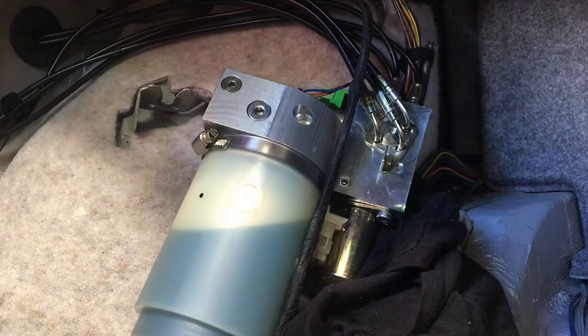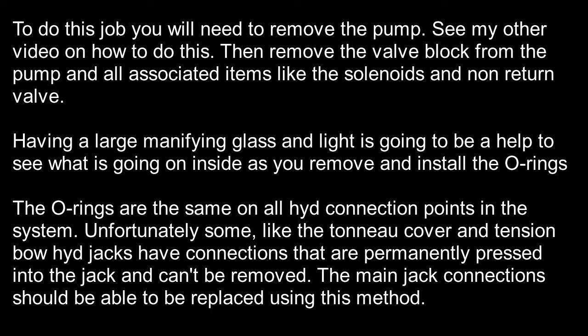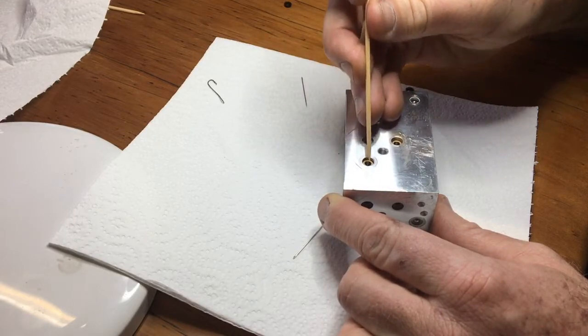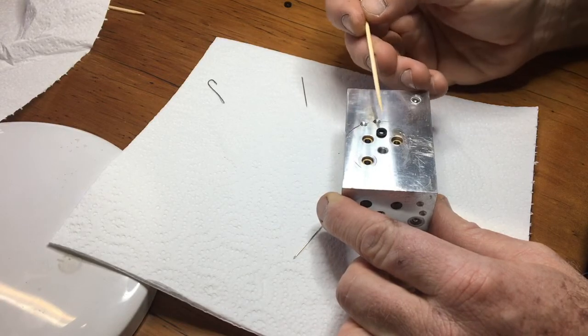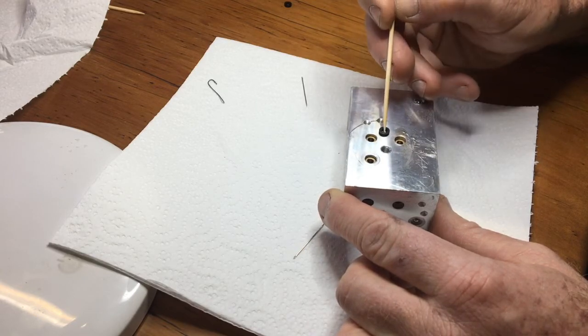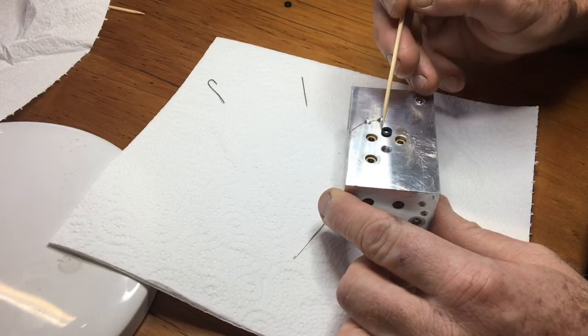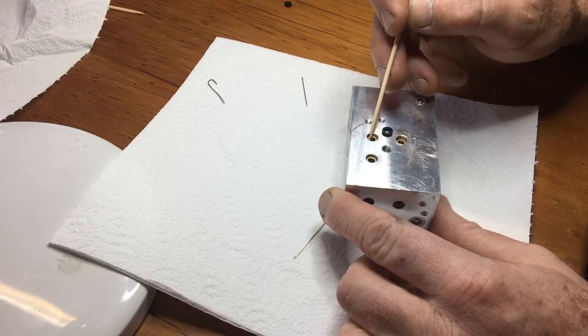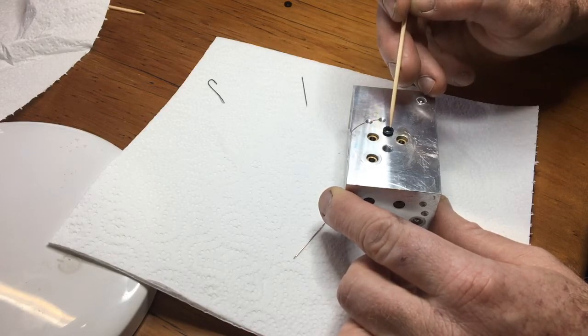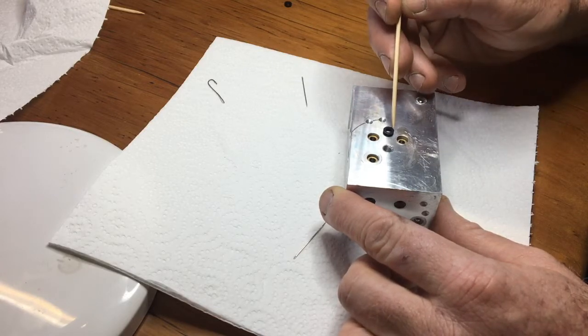So I'm going to replace the O-rings. The way these are fitted together is that for each of these connections, inside there's actually a square section rubber O-ring — size 006 — behind that brass bush. I'm assuming the way these are constructed is that the bush isn't there to start with; they put the rubber O-ring in and then push the bush in. You can drill out the bush and replace them, or you can just remove the O-ring and replace it. It's pretty tight. The dimensions are size 006, which is a standard size O-ring, but these are square section.